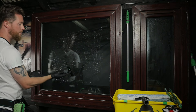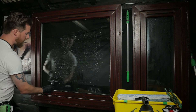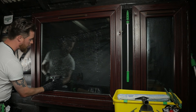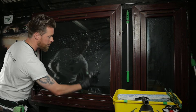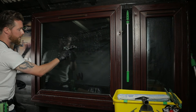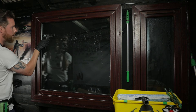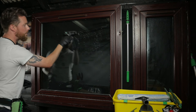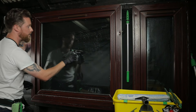So all we have to do now is the middle section. What I would advise is put your blade at the bottom of your cleaning solution that's left and go up in stages, working your way up the window — always push up, lift off, push up, lift off. It'll become a fluid motion: push off, push off, push off, like that.